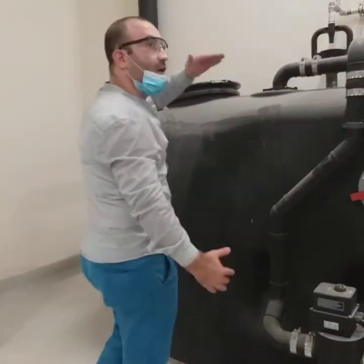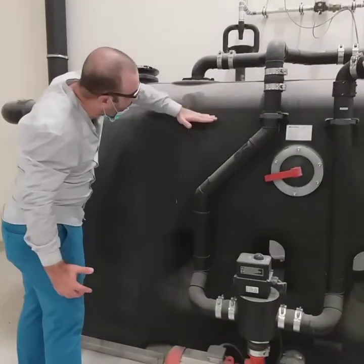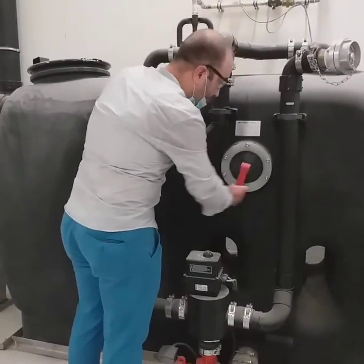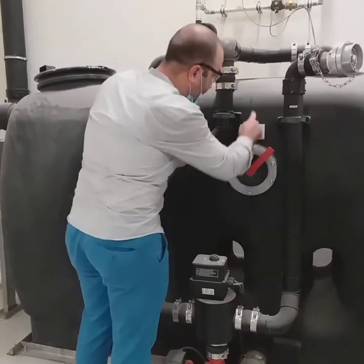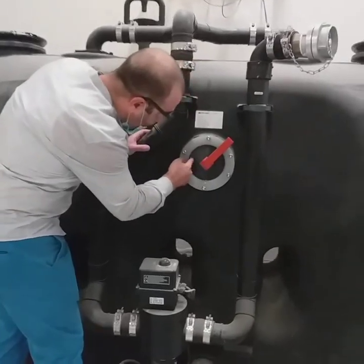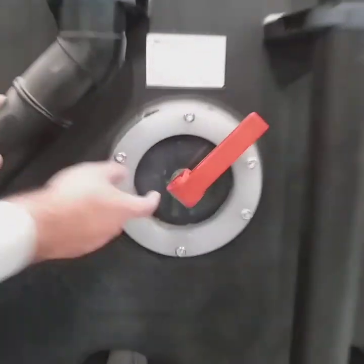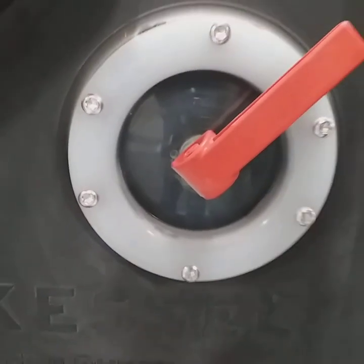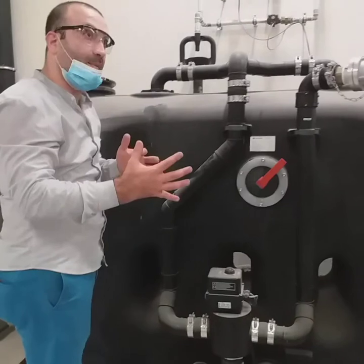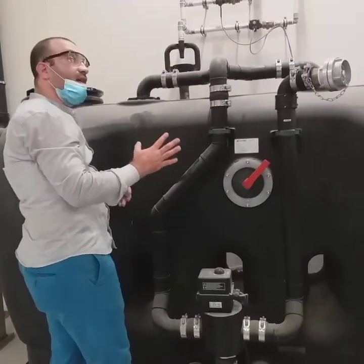Now, during the process, during the month, grease will start accumulating from up to down. You can monitor it by the wiper here. We have an inspection window where the grease level starts increasing. When it reaches the middle, it means we have reached the maximum. It's not allowed to go downside, because going downside means you are going beyond the level of the highest capacity. So when it reaches the middle, it means we are at the highest.